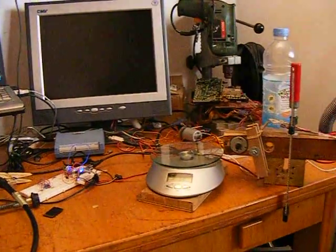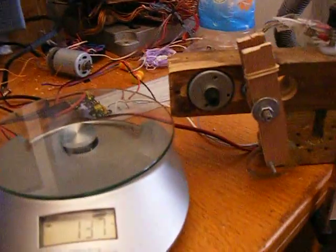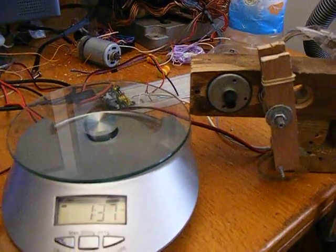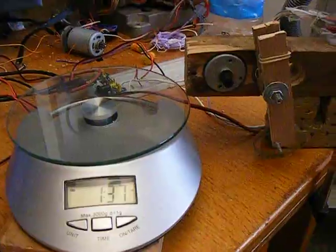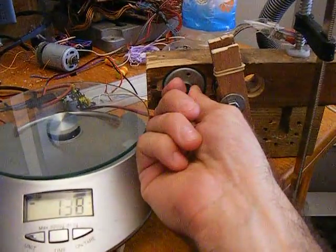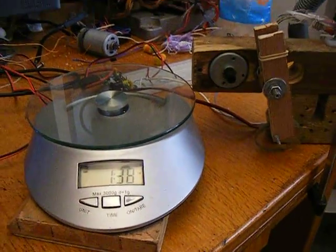Alright, so I wanted to show you what I'm going on about lately over here, and what I'm doing is a Prony test, which is a test for a motor torque in a given RPM, or what you all commonly know as HP, horsepower. So I wanted to see how much force I get out of a motor in a specific RPM. And doing that is quite tricky. It's very easy to just hold the motor down until it's stopping completely and then see how much force it puts down and calculate that, and then you have the stall torque.